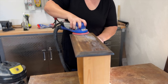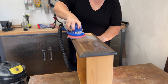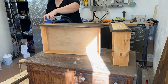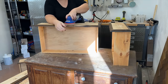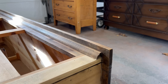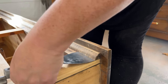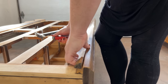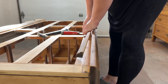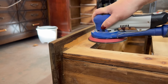Back to my coarse 80-grit — it was way easier to remove just this thin layer of stain now. I wasn't going to be able to get a sander around this piece of trim across the top, and it was just tacked on with a few little finishing nails, so I used my scraper and a hammer to gently pry that up. This way I could get a good clean sand on the frame, and then use one of my foam sanding abrasives to get the stain off that trim piece without messing up the detail.